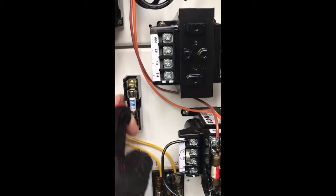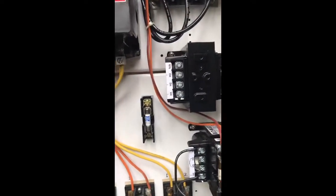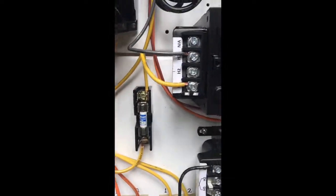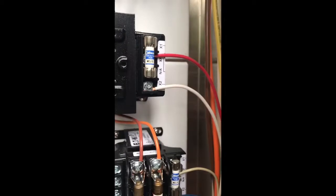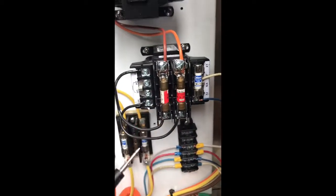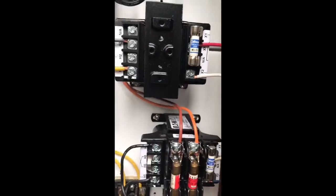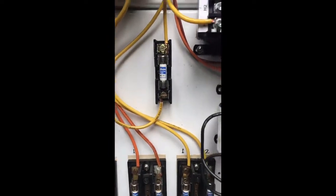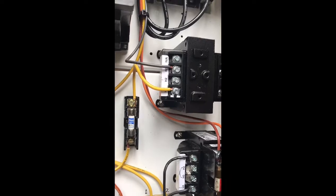Transformer steel is really thick - you're going to have to use wider drill bits before you tap than you think you will, or else you'll snap your tap. The neutral's up there; I've got a pretty big lug for a number 12 wire. Out of my fuse on the primary side, I've got a neutral going up to the neutral bar and my secondary fused. Now I want to see if I can get all the voltage on one leg.